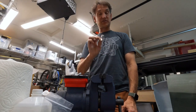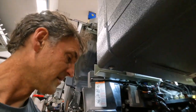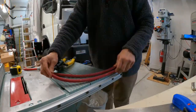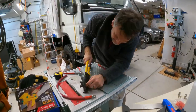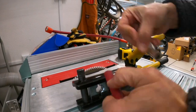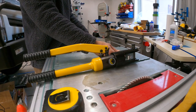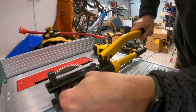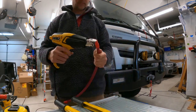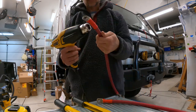That might work really well — let's go test this out. I've got my terminal nicely shrunk down. With a bent terminal or lug, you can even create negative angles, which sometimes works better for certain applications. As for crimping, quite frankly they crimp up just fine — you sometimes just need to open up the jaws and the crimp blocks to accommodate the bent cable. When applying heat shrink, you may need bigger diameter heat shrink, or you have to fit it on before you get the lug crimped so you can get it over that bent angle.